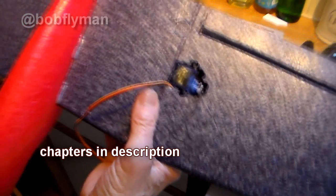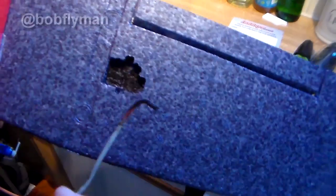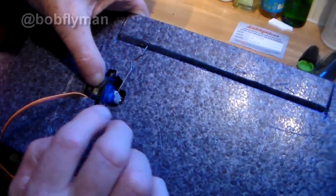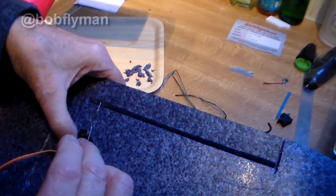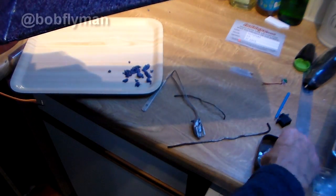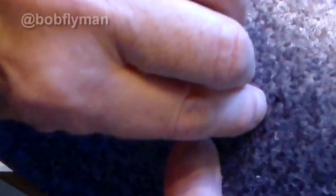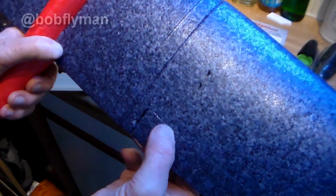First off, this is the best method I've found of installing the aileron servos within the wing in these bigger little foamies. First thing I do is mark around it, cut a sharp edge with the scalpel blade, cut out some with the blade, and then using one of my little tools, heat it up over the gas and just melt the way through. The servo fits nice and snug in there. Then, to know exactly where to make a little slot, take a sharp pin and put it through exactly where I want the lever to be. Looking on the top, you can see exactly where to cut the slot for the operating arm to come through, and the actuating rod will come across on the top to the control arm.